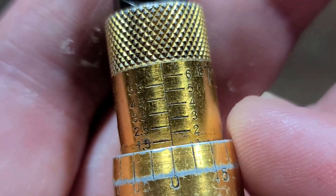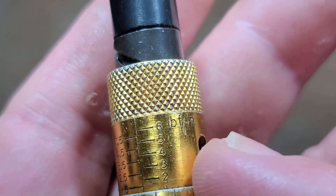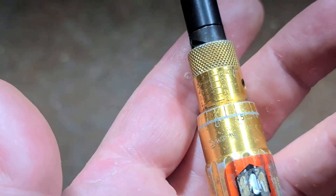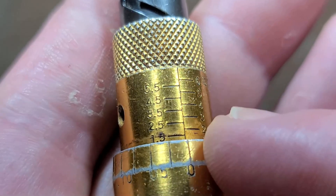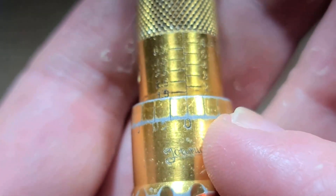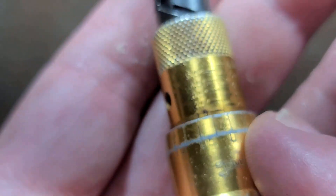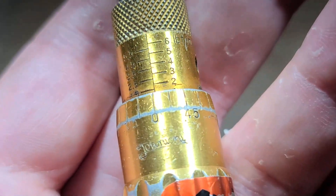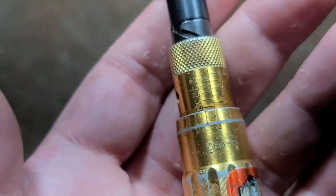As far as the range, we know it's precision. If you look here, it goes from one to six inch pounds. So maximum torque is six inch pounds. This other scale is actually just half, so spinning at 360 degrees goes up half an inch pound. As we can see the graduations here, each tick mark is 0.025 inch pounds. So you can really get precise.